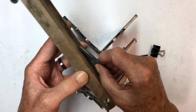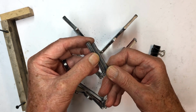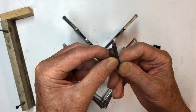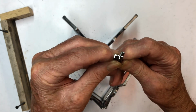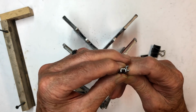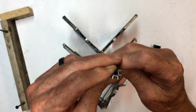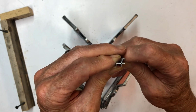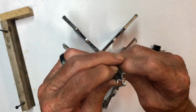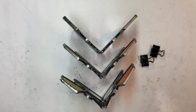If you don't do that, then you're trying to figure out how am I going to get these two to line up where they'll be on top of each other in the correct position. Otherwise, they want to look like this. If you don't have something in here to keep that up there, these will start getting down in here. They'll get crooked, and then you'll have a kind of a big mess on your hands. So you need some way to shim that up. And when we get on to the bigger jig, you'll notice I put in a little piece of wood that goes along here that's that thickness, so it keeps that propped up. So the jig is good to use to get them together.